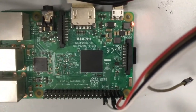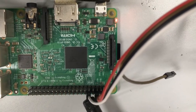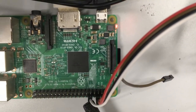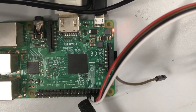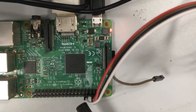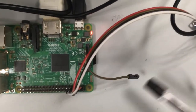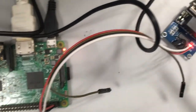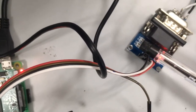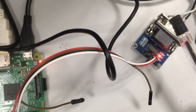On the Raspberry Pi side, I am using Raspberry Pi 3B. GPIO 15 is the RXD pin. GPIO 14 is for serial transmission, which I will not be using because Raspberry Pi is operating in receive/read mode here. The white wire is connected to pin number 10 (GPIO 15). Additionally, red and black wires are used for powering the module — these are connected to pin number 1 of Raspberry Pi, which provides 3.3 volt DC. So only a three-wire connection is needed: red and black for power and one RX wire for receiving data from the RFID reader to Raspberry Pi.